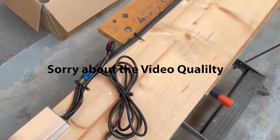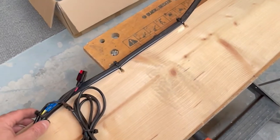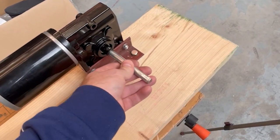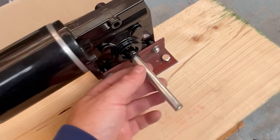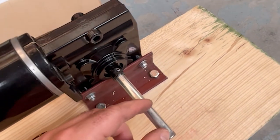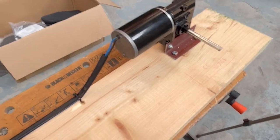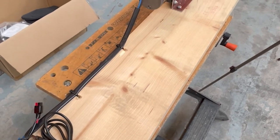So this is what we've got to so far. We have the box mounted, the loom with our potentiometer to control the speed, and cable ties up the side to hold the cable in place. The motor's mounted, the axle has been cut to length, and the 3mm roll pin is hammered through the axle to hold it in place. We still need to design a rotating mechanism to come off here so it can wear the grip, which will be mounted onto this part. We'll get everything tidied up and do all that in part 2 — so follow along and we'll get back to you in the next video.